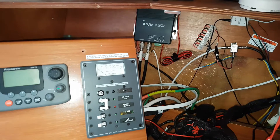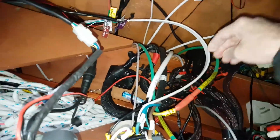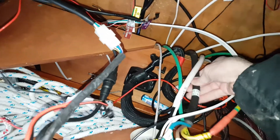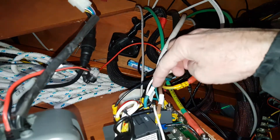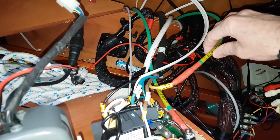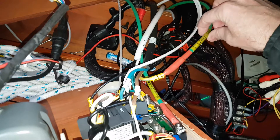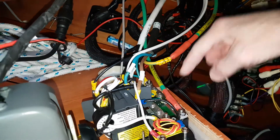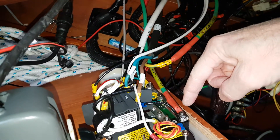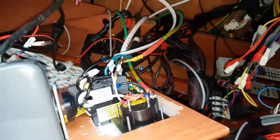Before it hits the panel, I've installed a galvanic isolator. The source wires from outside come out here — this is 10-gauge wire, three wires. The safety ground, before it hits the breaker, I've taken off that safety wire and run it through the galvanic isolator, and then it comes back on this wire. This is typically where you would connect your safety ground, but the galvanic isolator goes in here.